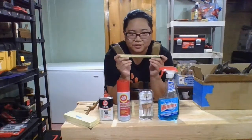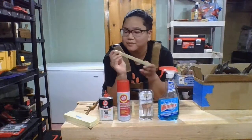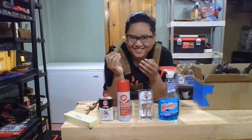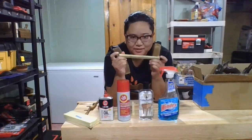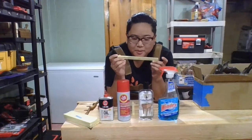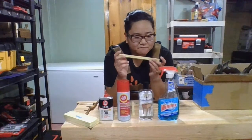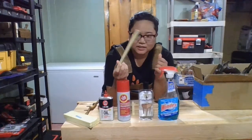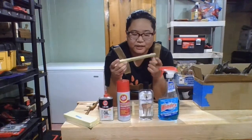Typically what people do — or at least what I do — is lap the stone. However, these are tiny; they're a dressing stick. There's not a lot to them. You don't even have to lap these, because you lap when your stone has gone out of flat, which happens with typical dressing stones. With this stick, it doesn't really go out of flat — or eventually it will, especially if you're not using the entire surface — but given how tough these are, it's highly unlikely. It will, however, clog.